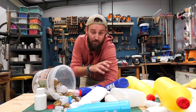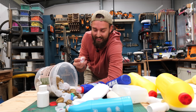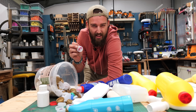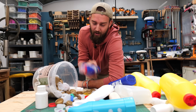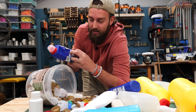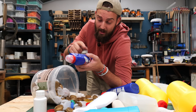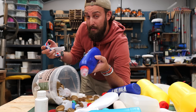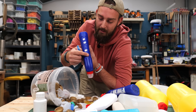So the next step when you're trying to process your plastic is to get rid of all the stuff that shouldn't be there, like the labels. You don't need to worry about pens and sharpies - that generally just vaporizes when it's melting. But if you've got labels on here you need to get rid of them because that's going to mess up your plastic when you're recycling it. Sometimes labels are made of paper and the paper part comes off relatively easily because it doesn't have adhesive all the way around.